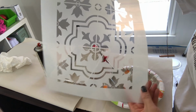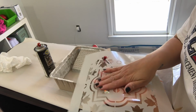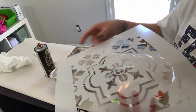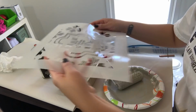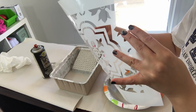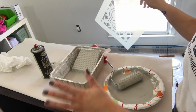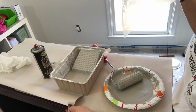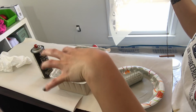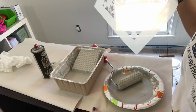All of the paint came off of it. What I did find that happened was, and I believe it's because of the paper towel brand that I happened to use this time, the fibers from the paper towel were actually sticking onto the spray adhesive whenever I was rubbing it on between applications on the wall, so that I would get any bleed over to automatically come off. So going forward, and I suggest you just start this way to prevent this from happening, use wrapping paper or tissue paper, like for putting in gift bags, because that doesn't have any fibers that would come off like a paper towel.